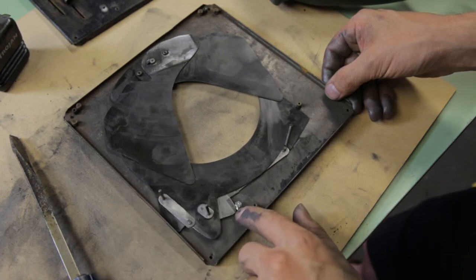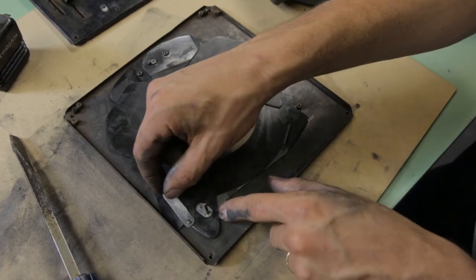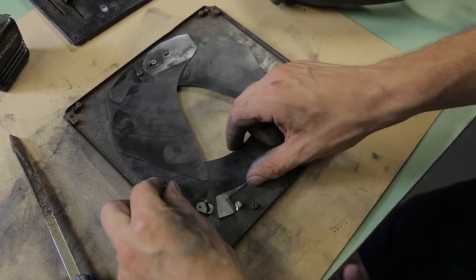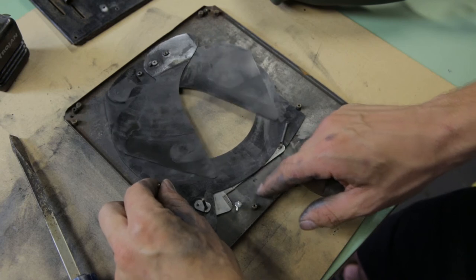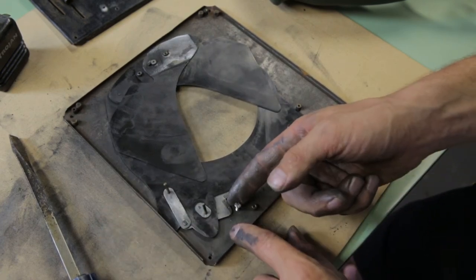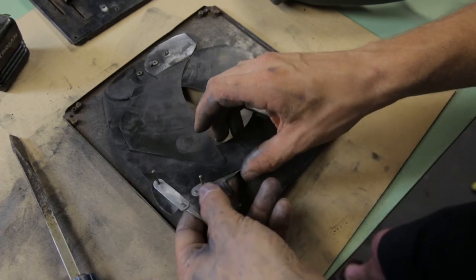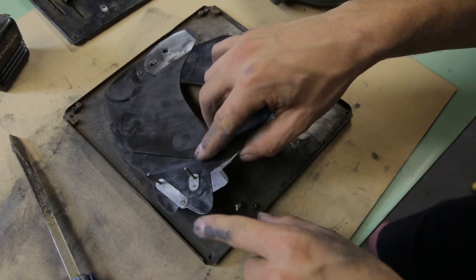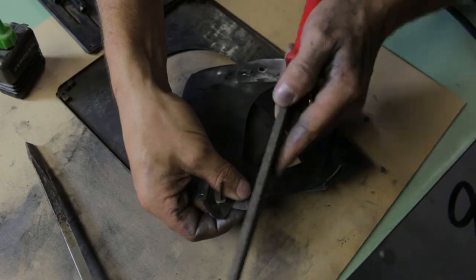...this leverage action here is coming in too early; it's going to be kicking me out of here before the shutter is open. It needs to be pulling down here instead of getting kicked off like this. I can fix this if I could just shave a bit of material off here to accommodate the fatter pin. Let's go.